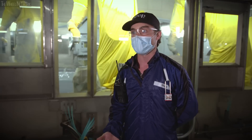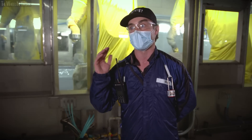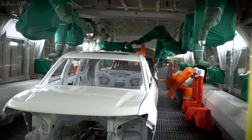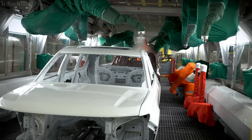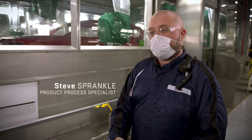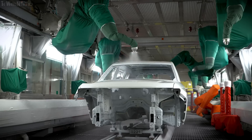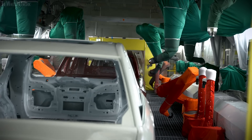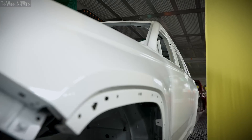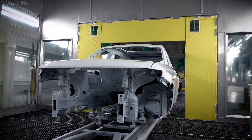Following the two-tone process, the cars go through an oven where those paints are cured before being painted with base coats and clear coats. We're in the top coat area — base coat two. It goes through a dehydration zone, removing all water and solvent from the paint, then into the clear coat zone, which applies the final protective coating to the surface of the vehicle. The final step is the oven after clear coat — they cure, and when they come out, they're ready to go outside.